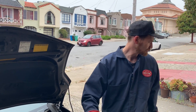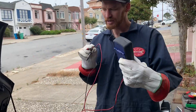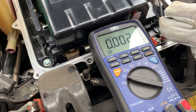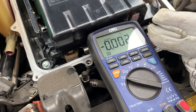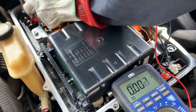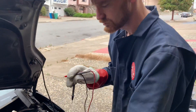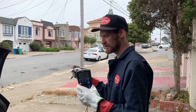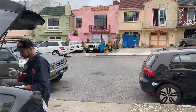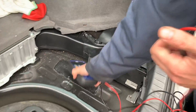As an overlapping safety procedure, I'll use a CAT III meter — a thousand-volt-capable meter — to test for voltage. I'll test the terminals and from the terminals to ground: nothing, as expected. Final verification: I'll connect the meter to the 12-volt battery to confirm it shows 10–12 volts and is working. The meter works. I don't need the gloves anymore and can proceed to undo those terminals and remove the inverter.